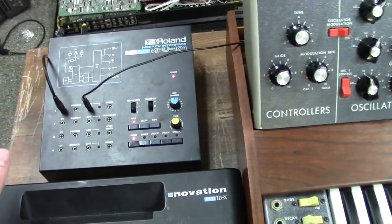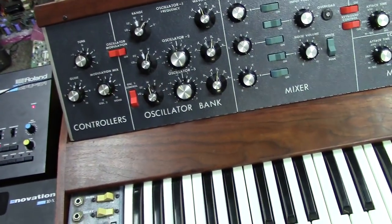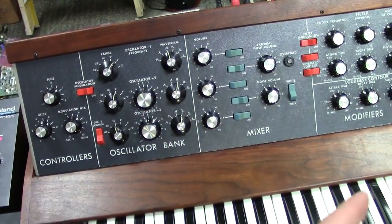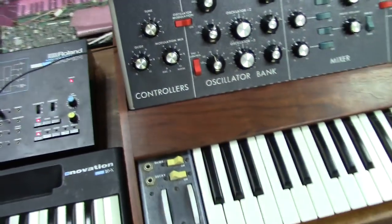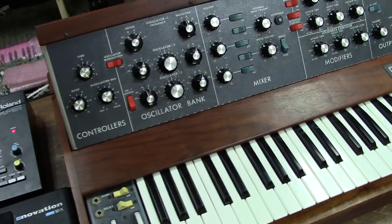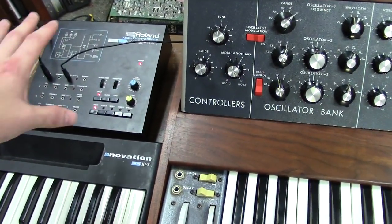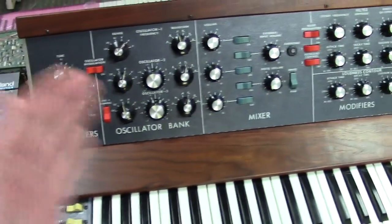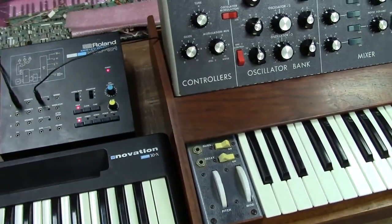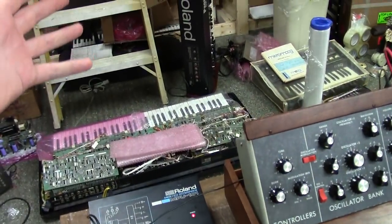That sounds great on paper, but when you actually start playing with it, you find that tracking problems exist. Tracking problems within other octave ranges start to show issues. And that's where the story kind of ends as far as really accurate control. Now, keep in mind, if you're using a Kenton MIDI controller or something like that, they already have the compensation stuff inside where you can actually go in there and set things up, and you can do compensation for octaves and all that kind of stuff. Different story. This is if you're really just wanting to use CV, like an old system setup.